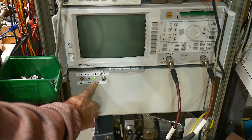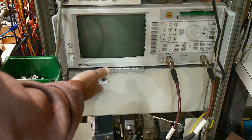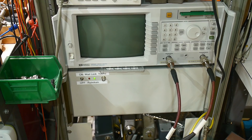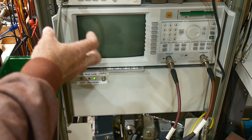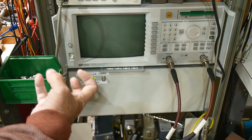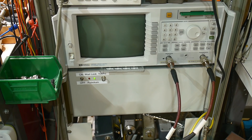Down below here in my rack is my rubidium standard. It's a used rubidium standard out of a cell site — they want really accurate frequencies there. They used to be around a hundred bucks, but they've gone up in price, maybe around 200 bucks now. You actually have to add a couple of things — you need to add a power supply. They're quite power hungry because you have to heat up what's called the physics module in the rubidium standard. You need to run them hot so the plasma in there is nice and stable, so it requires a hefty power supply. It also gets quite hot, and they're supposed to be bolted onto a heat sink, so you have to supply your own heat sink too.